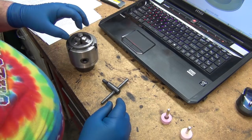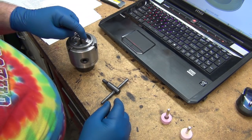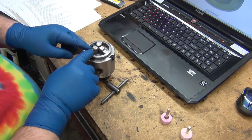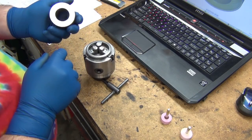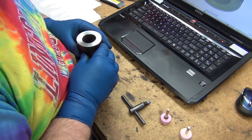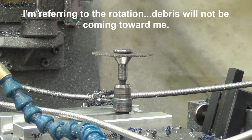If the diameter I grind it to now is just a hair small, that just means the crown — the center of each jaw — will grab on here instead of the outside edges. The outside edges were what was grabbing before. So I had six sharp points, and if I really cranked on it, it would actually leave marks — they got machined out later, didn't matter. I went ahead and opened it up. Oh yeah, I opened it up almost a hair too big. Now we're going to try doing this with the jog — both the chuck and the grinder are pulling it away from me.